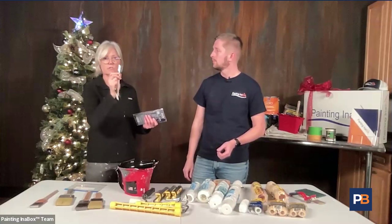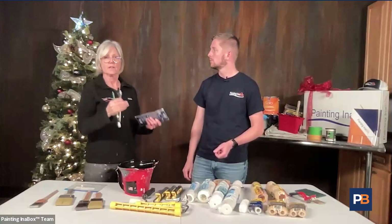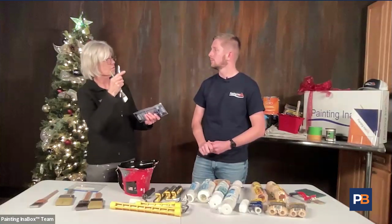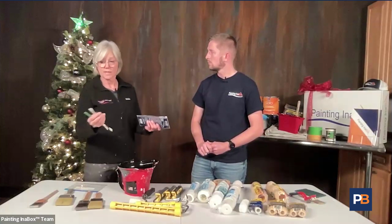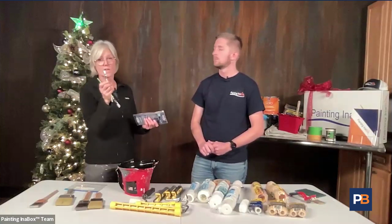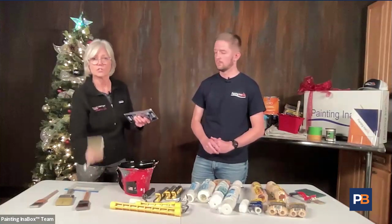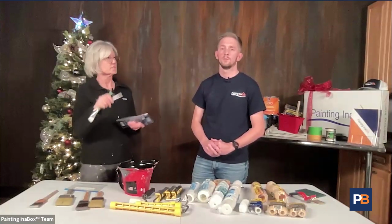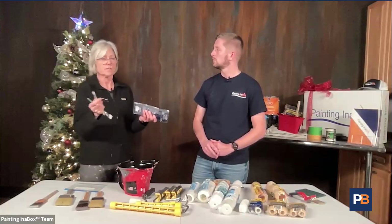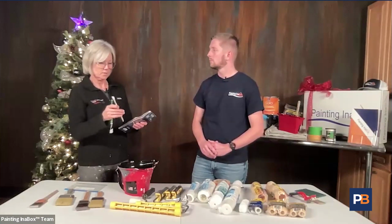So you can get in, say there's a corner, say there's a bathroom vanity and you cannot get up underneath in a corner, or in a lower part, or along a kitchen cabinet. These are great. So just stop, don't fight it with your big brush. Don't get frustrated. Go grab one of these, and you can even wait until you're completely finished, except for pulling tape, and then dab this, and they work great.